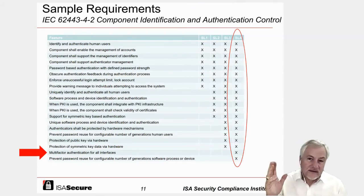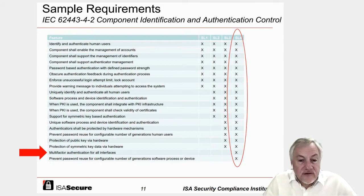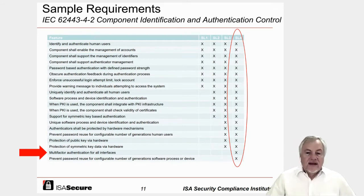And let's add to that: by targeting the highest level of security, let's also look at the IEC 62443, which is a requirement that has four security levels identified. The fourth level is marked by multi-factor authentication for all interfaces. If we had something that acted like multi-factor authentication — machine to machine, between the sensor and the network — we'd have something that was strong.